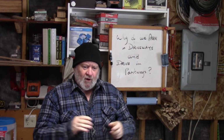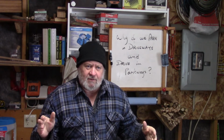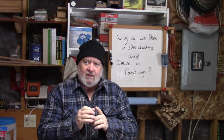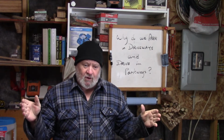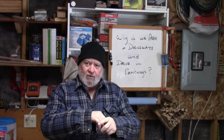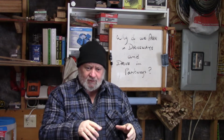So before I go ahead and buy new hoses and change them, I thought I would try something. Last time I was in Princess Auto, they had this fabric tubing that you slide over hydraulic hoses for protection, so I bought some of that. What I'm going to try today is cut a length of that and see if I can fit it over the hydraulic hoses to protect them from the scuffing and scraping that comes from the tire.